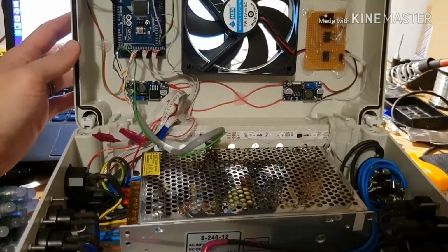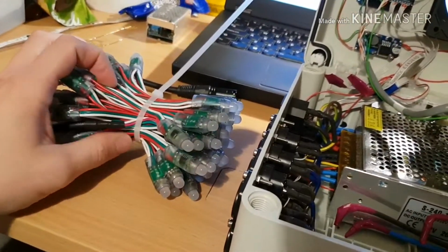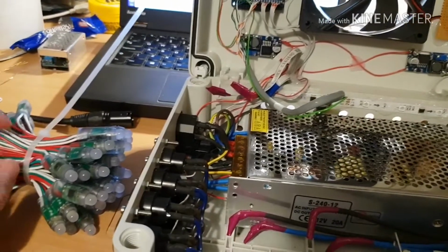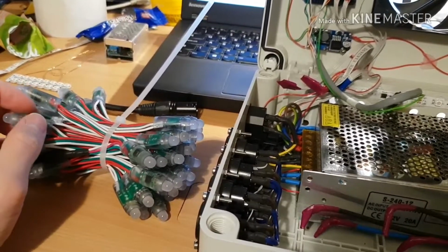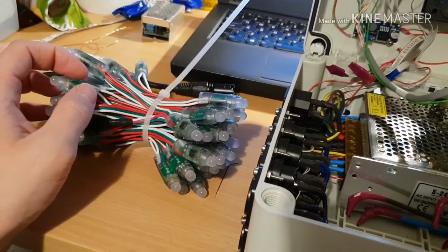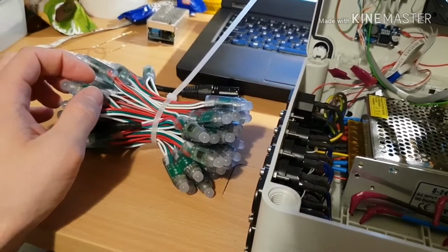So those pictures you've just seen were from my wedding. It's kind of the same system, the same LEDs, but I structured it slightly differently for that installation. I had 8 logical strings and 16 physical ones, and each string had an output from the centre to an edge of the room. It then went along one wall and came back to the middle again, which simplified the control.